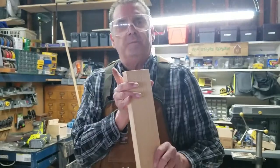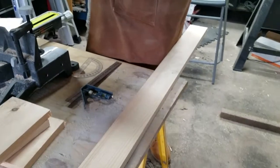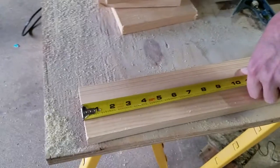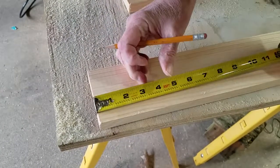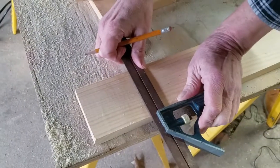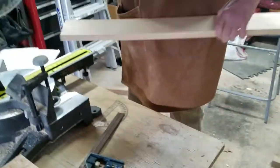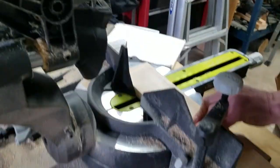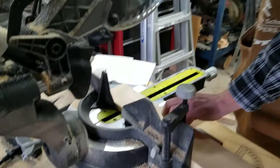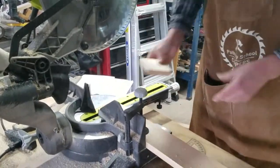Now we're going to take the three-and-a-half-inch piece because we need the front, back, and bottom. The bottom was three and a half by three and a half, so I'm going to measure that out — go three and a half, mark that, combination square, mark that off, put it on the miter saw and cut this piece. Bring it down, get it lined up, tighten it up. There's our bottom.